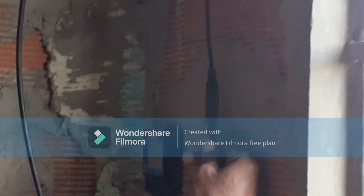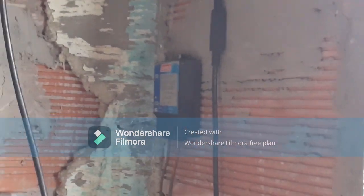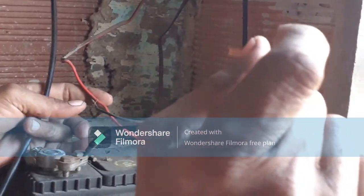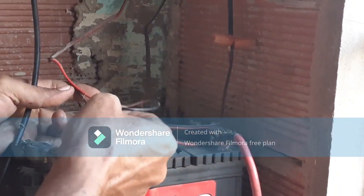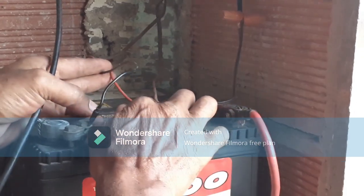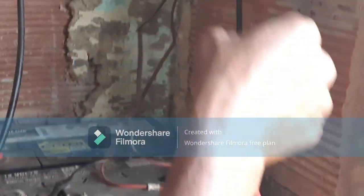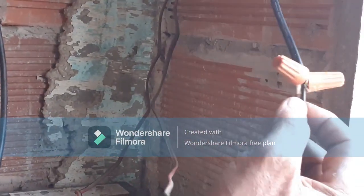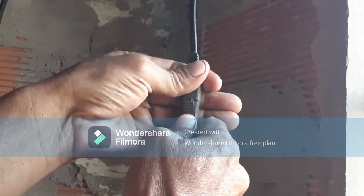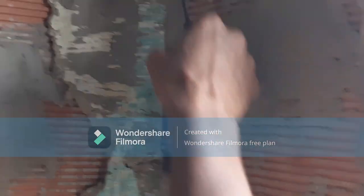This wire comes down here and this is a regulator. From the regulator you have a red and black wire — they have two ring terminals on them. You screw the black ring onto the negative side of the battery and the red onto the positive. There are also two bare wires without rings that you connect going out to the solar panel. The charging from the solar panel comes through here and goes through the regulator to the battery.